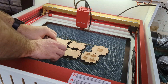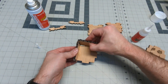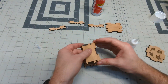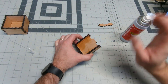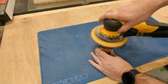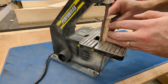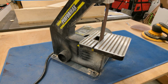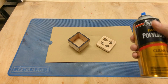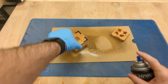With the parts all cut out, we just make sure everything looks like it's cut out cleanly, all separated and looking good. We bring them over to the bench — for this I'm just using some Starbond thick CA glue and then I'll hit it with some accelerator. These aren't necessarily that structural; you could use wood glue and clamps, but this makes the process faster. You just want to be careful you don't get too much squeeze-out that would ruin the finish. Then we take it to the other shop for sanding — I'm going for a bit more of a clean finish on this one, flushing up the edges, making sure the top is smooth, then taking it to the belt sander and giving each edge a nice round-over. Once sanding's done, I go ahead and use a satin polyurethane finish with some light coats — I ended up doing about three coats over the course of a day.